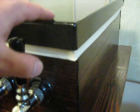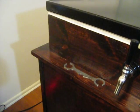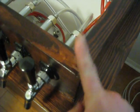In fact, my lid doesn't land perfectly. This corner has a little bit of spring to it, and I might be able to fix that with the hinges in the back, but I think I'm just going to have to keep something sitting on the lid, which I don't think will be a problem. So, moral of the story, go with some finer, non-dimensional, finish style lumber. Glue two pieces together if you have to. And if you want a perfect miter, get a miter box.